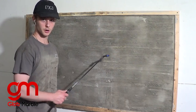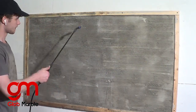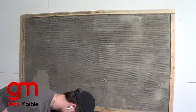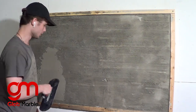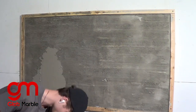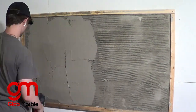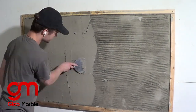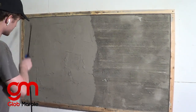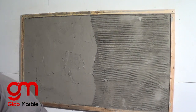Again, we have to dampen our concrete with water or else it's not going to stick. The first coat you put on is going to be a thin one — you want to get it really deep into the cracks in your scratch coat. The second coat is the face coat, and you want it to be really nice and fluffy so don't press too hard.